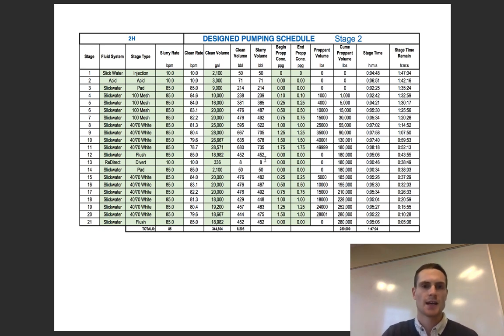Before pumping the diverters, they go to a flush with no sand volume and pump the diverter at a very slow rate — you don't want to pump diverters fast; you want to get them down to the bottom slowly so you don't obliterate them right into the perfs. Then they start a new pad to establish new fracture networks, and after that they start pumping 40-70 sand. In this case they didn't do 100 mesh again after the diverters — probably because there are already a lot of fracture networks down there, possibly to save on cost.